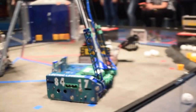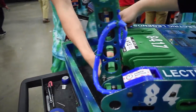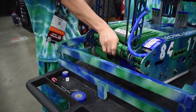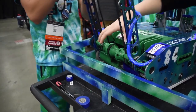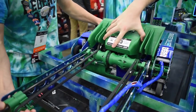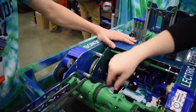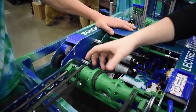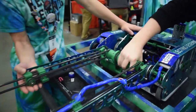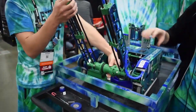One of the other cool parts of our arm is this whole axle right here. It's actually a coaxial axle. There's a live axle which rotates the arm, and then there's another separate axle around the live axle — that's these 3D printed parts from right here to right here. That's driven by this motor right here. You can see this is belted right here. It rotates this entire 3D printed piece, and that is what extends our arm. We're actually able to turn and extend the arm from the same pivot without loading any of the motors onto the arm itself.